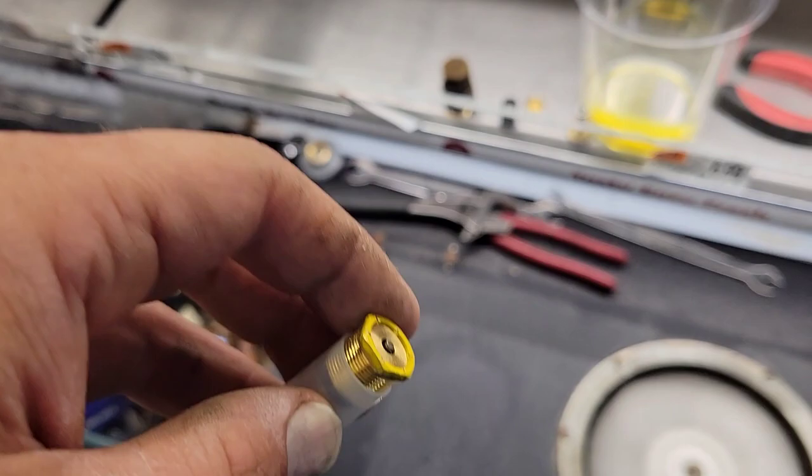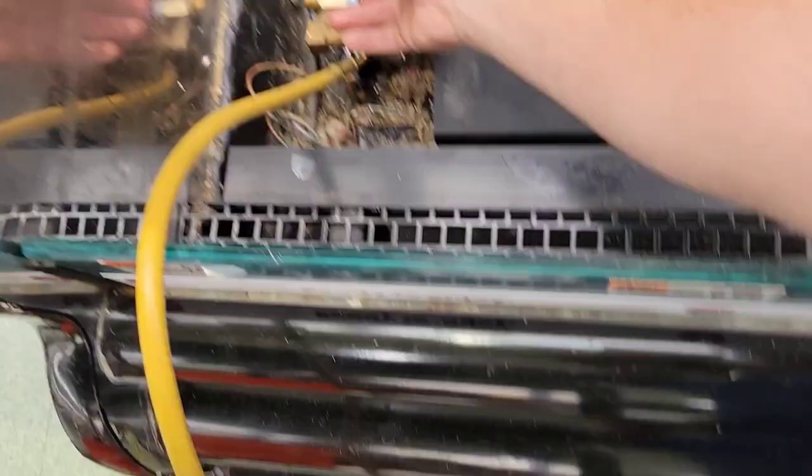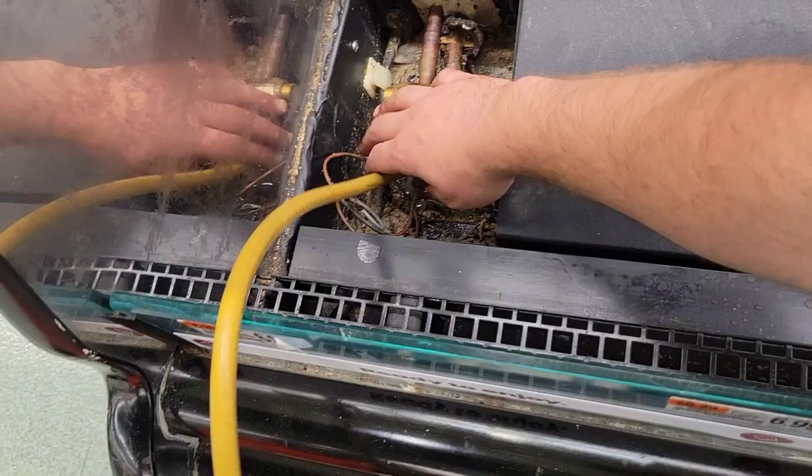Somebody asked what kind of degreaser I use - I use this degreaser. Sometimes when I go to FW Webb I use another degreaser; when I go to United they have them there. So I'm just going to degrease these components. I'm also going to spray it into the housing as well. So all of these things have been degreased. Now we're going to lube it up with the oil we just got from the roof. Lube it all up and we'll put it back in place - except this cartridge; this cartridge is no good. We're going to put the new one in. Put oil over everything - threads, gaskets. Take your fingers and put it inside the valve, all over the threads. Really make sure it's thoroughly oiled before you put it back together.